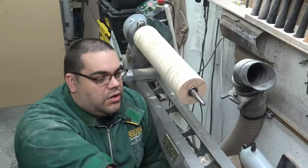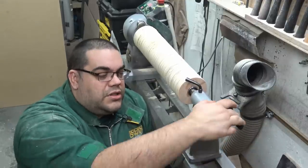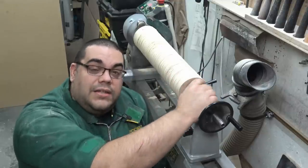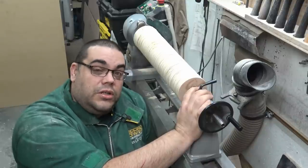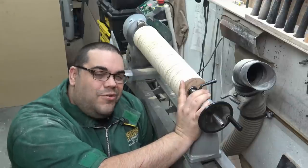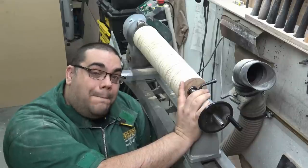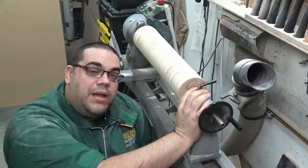So when I want to use it, I've screwed it on that end, bring up the tailstock — that just slides over — lock it all in place, just nip that up to provide a bit of pressure, lock the tailstock so it doesn't move about. Now that is pretty much secured. All that's left to do is to true this up just a little bit with the tool, and then we'll finish truing up with the sandpaper.